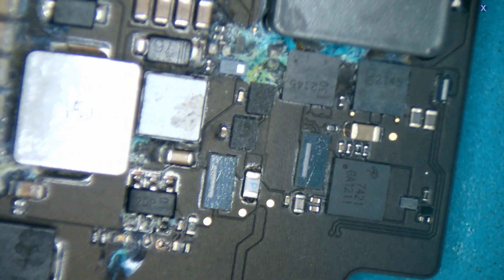We're looking and we see a lot of corrosion in lots of areas — this isn't good. There's not much to scan because it's everywhere. This would be one of those cases where we most likely want to put it in an ultrasonic, because not only could it be surface corrosion but it could also be underneath some of the BGAs. The solder could be loose. Also, this is where our backlight area is — you see that line that looks all about the same? Those are all caps and they're usually backlight caps. So if you turn it on, you probably won't get a backlight anyway.